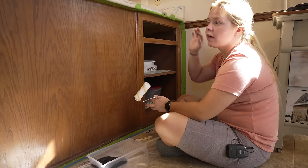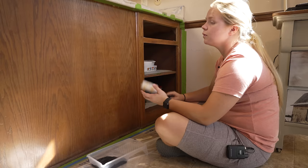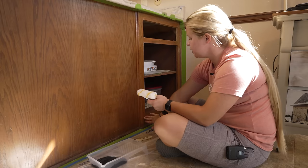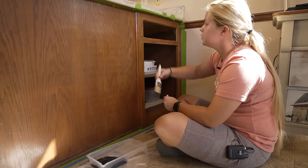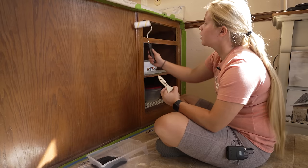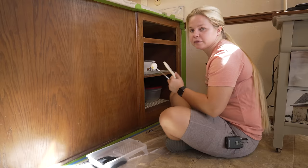Basically what I've been doing is going over all of the flat areas with my roller and then coming back to stipple the areas where it is raised or has more detail. Remember that stippling motion is just quick up and down motions. Beyond Paint recommends that you don't use your brush in a brush motion, but that you stipple, and then once I'm done stippling I'll go over it with my roller one more time to even it all out. The top there only took me about 40 minutes, so that's pretty good time. Let's get down to the bottom.